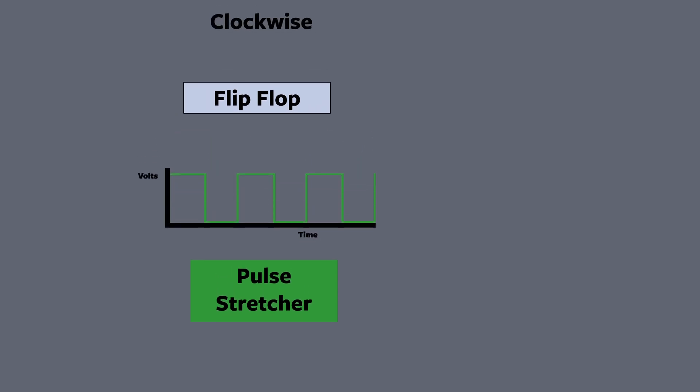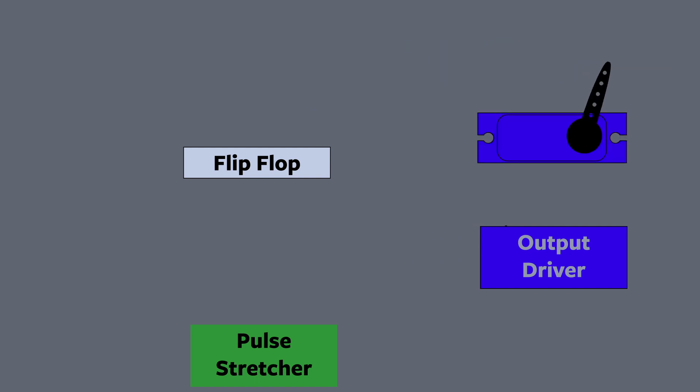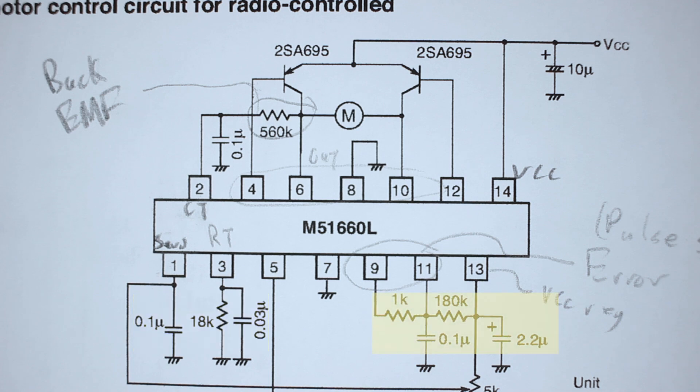So we have a direction value in our flip-flop, and the pulse stretcher output and the flip-flop value are both sent to our H-bridge. This H-bridge turns the motor clockwise or counterclockwise at the speed we've been telling it to go. There's not a lot of current that can go through the little chip, so the manufacturer might use two external pins with PNP transistors to allow higher current. The data sheets for a bunch of servo chips are linked in the description below, and you can see there are capacitors and resistors on the board that you can use to change either the pulse being read from the potentiometer or the dead band seen by the pulse stretcher.